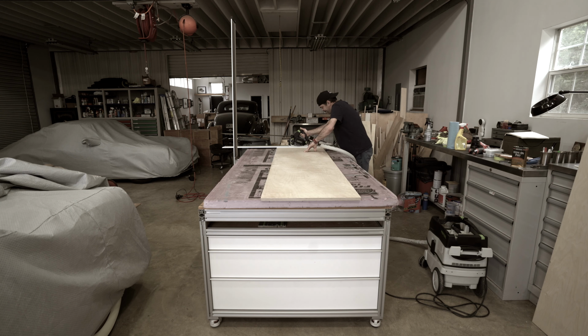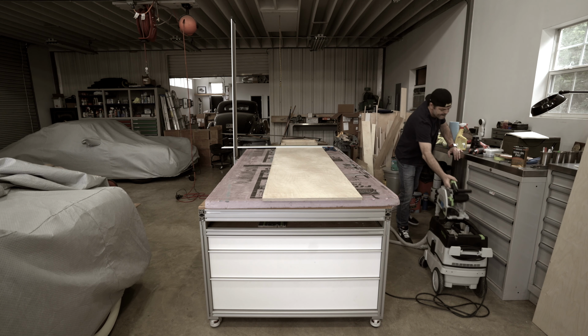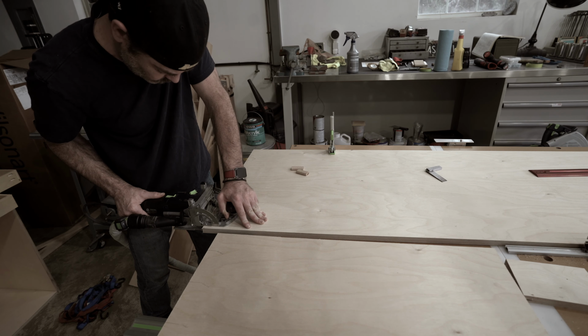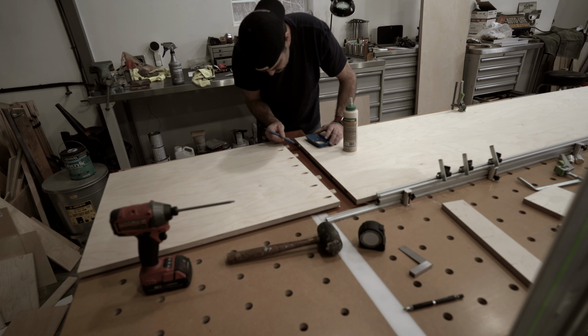to do about joinery. The front edge of this top is a focal point of the desk, and I didn't want these staggered joints to be visible at all, so I needed them to be very tight and precise. I ended up using dominoes for alignment and lots of pocket screws for clamping force.